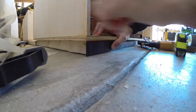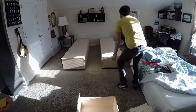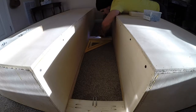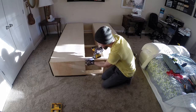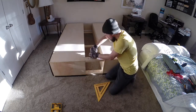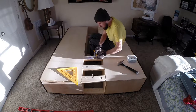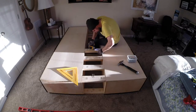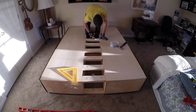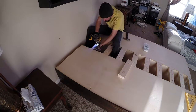After that, I tacked on the trim to cover the 2x4 frame and took the pieces to the guest room for assembly. Everything was held together with 2x4s and pocket screws. With the half inch plywood, I was afraid there wouldn't be enough material for the screw to bite into for adequate support, so I cut some 2x4 in half and glued and nailed that in place on the inside of the bed pieces where the screws would be coming through — this allowed me to use longer screws and really helped with the extra support. The top of the bed between the vertical supports made me a little leery, so I added some leftover 5-quarter decking material, and after that it felt super sturdy and solid. If we'd just started with the 3/4 inch plywood I could have saved myself the headache, but it was only a few extra screws and scraps so it really wasn't that big of a deal.